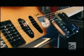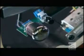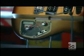The pickups are basically six magnets wrapped with a very fine copper wire coil. The wire is thinner than a human hair and wound around the magnet 7,200 times — uncoiled, it would stretch the length of eight football fields. These knobs control volume and tone, and this is the pickup selector switch. The tone knob acts as a kind of filter; it works with a capacitor built into the circuit board, getting rid of high frequencies and giving the guitar a warmer, fuller sound.